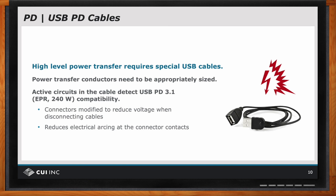It will detect when you are disconnecting the load, so if you're drawing a large amount of current, it'll quickly drop the current and drop the voltage before the load has been totally disconnected so as to minimize the arcing. So yes, the USB consortium has considered that there may be some challenges when delivering higher power levels, and they have definitions of what to do for the cabling and connectors to take care of that.